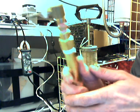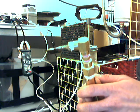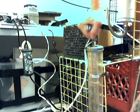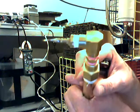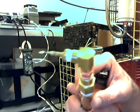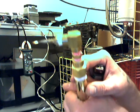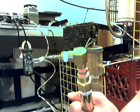It is a 44-amp flame. Lowering this down — it sticks down to about 20 amps now. That flame barely wants to run at 20 amps. That's the lowest wattage flame I've ever been able to make. It looks like my 50-amp flame at 12 volts — I'm serious. That's how much better this low voltage is working. It looks exactly like my 50-amp flame on 12 volts, and I'm running at 23 amps.